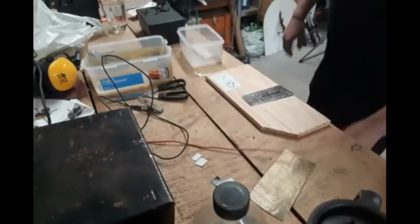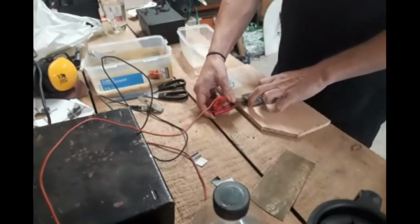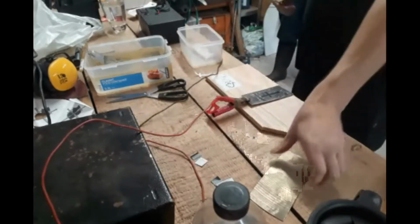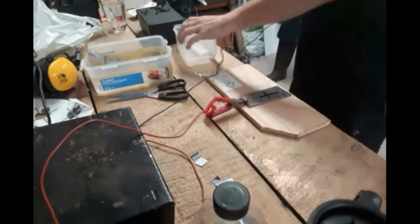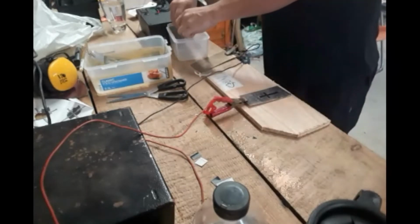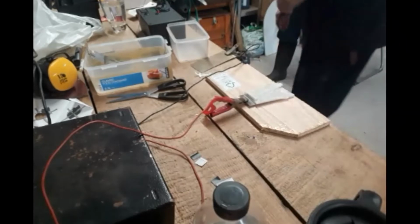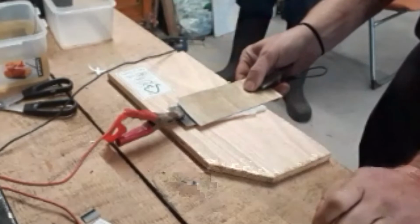So I'm going to attach my electrodes, and as we said, the bit that's going to be etched is the positive one. That's going to be the anode. Cathode is going to be this brass plate. I really want to not make these touch at all, so I want to keep that quite safely distant so I don't accidentally catch them underneath. I'm going to put my electrolyte on there, got the charger turned on, and I'm going to put the plate on top of that one.